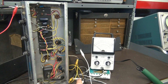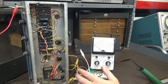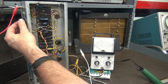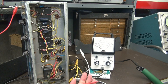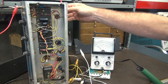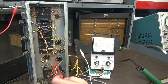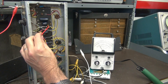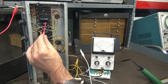The chassis is pulled. I've got an 8-ohm dummy load here representing the speaker, so I'm not going to irritate you with that tone. We're monitoring with the VTVM right across that resistor. I'm going to bring up the volume to where we get a level — there it is. Now I'm going to take my magic tapper. First we'll just hit the tubes. Did you see that? She really jumped when I did that. Let's go down the board, just tap on stuff. Look when I'm hitting that cap — I'd say we've got an issue here for sure.